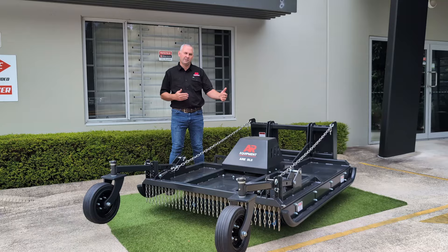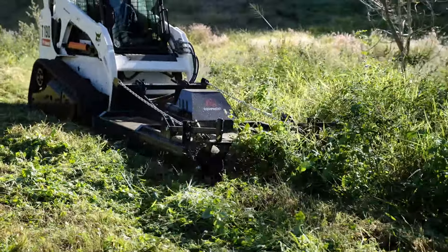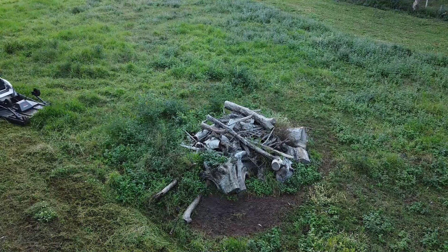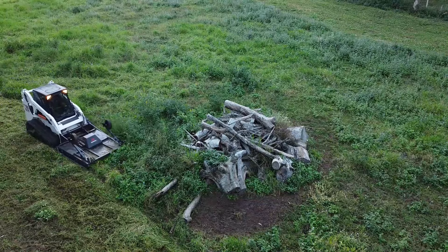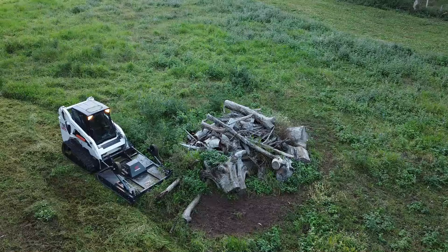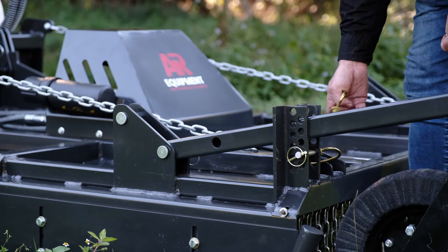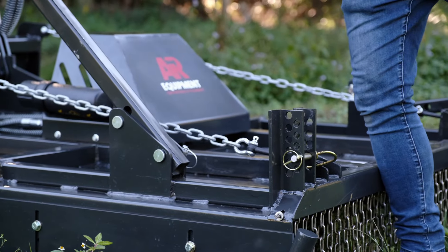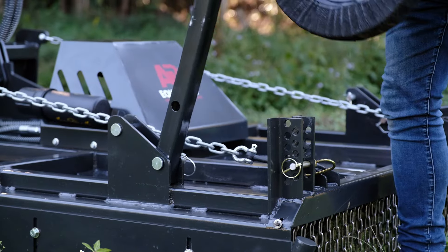That's why we've chosen the deck size. From there we have our jockey wheels. The reason for twin jockey wheels is so that when you hit a rut, debris in a paddock, or a change in direction going up a hill with a big lump, it's going to slide up over it and stop the slasher from digging on the side skids. The beauty with these is you can fold them away into a vertical position — they'll pin off — so you can work up close to trees or against the side of a bank without them impeding you, while still giving you the ability to be faster in the paddock.